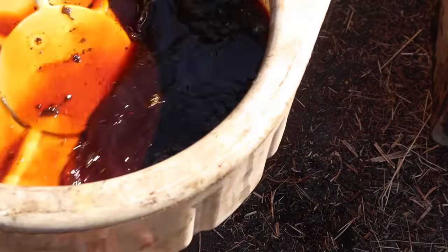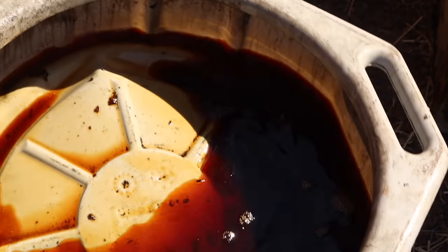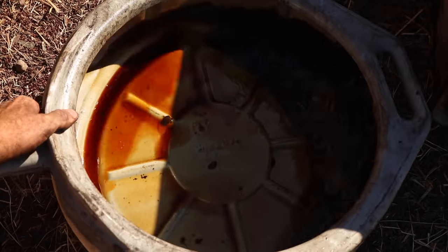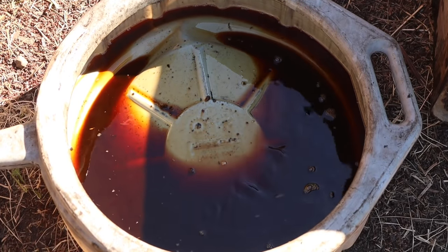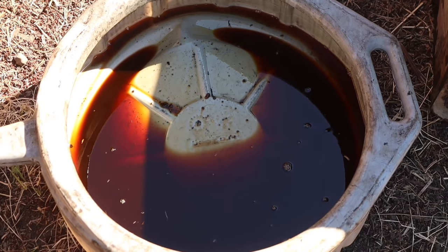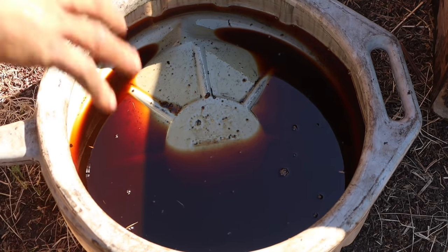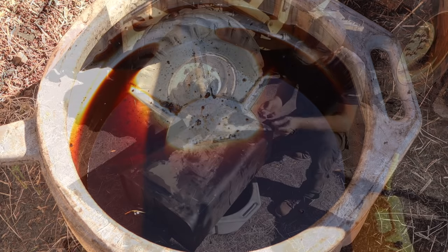So this is what we're dealing with. It was definitely probably red diesel, but it has gone stale, varnished up a bit. So I'm gonna put some clean yellow diesel in it, shake it around. The inside of the tank looks really good. It definitely doesn't look pitted. A lot of the junk you see in this pan was already in it, so there isn't a ton of sediment in that tank, which is great. So we're gonna clean it out, put it back on.